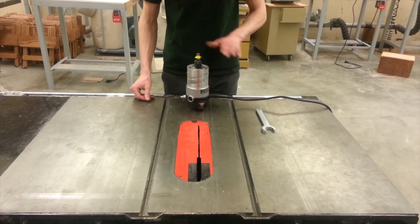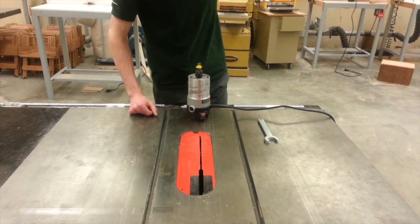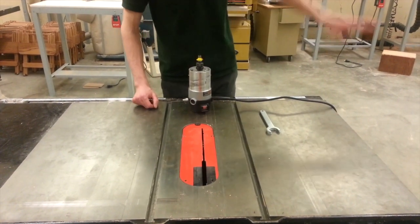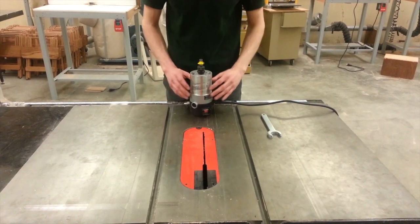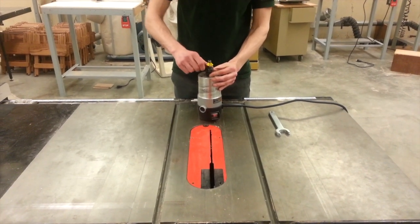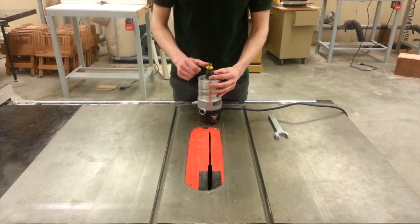For this demonstration I'm moving over to the table saw. If you're tall enough, you can actually tighten it on the router table. If you're shorter, you can do it on the table saw or the radial arm saw. To tighten it down, you first want to twist it by hand and take note of which one you're holding still and which direction you're rotating the other.